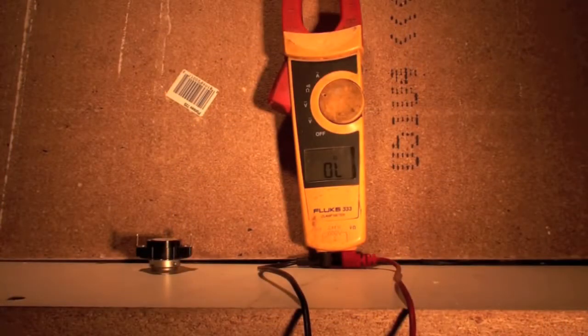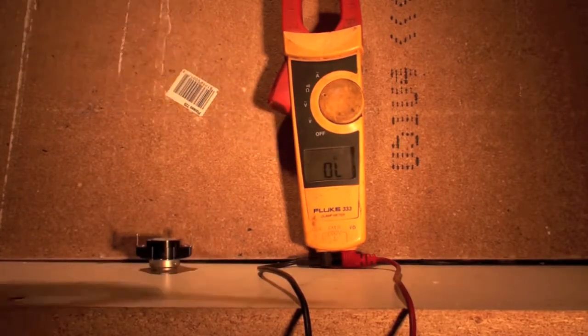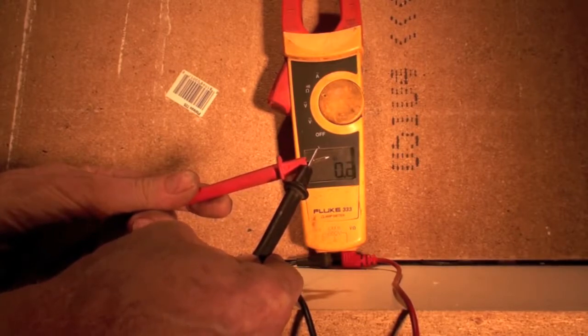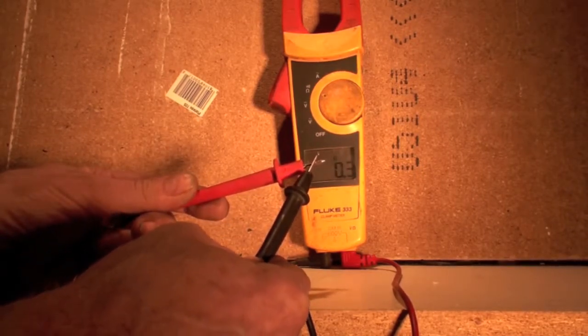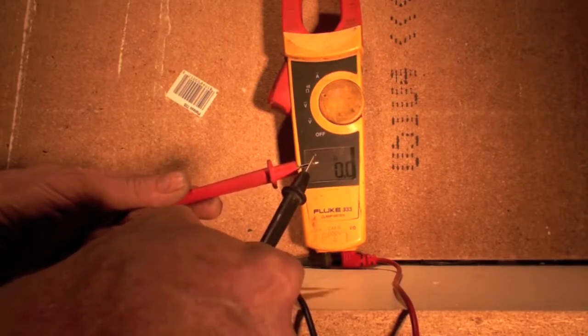Okay, I'm going to be testing the ohm meter on this thing. Now, if you look, you can see we're in the ohms position here. We're showing that funny U down there and the OL, which we will normally see whenever there's no continuity. Now, to test that I don't have a problem with the leads, I can simply short them. And it's going to beep. And it should show well below 1 ohm. I'm not showing any ohms at all.